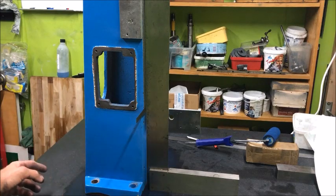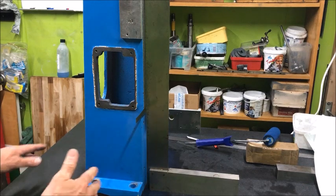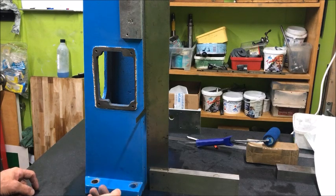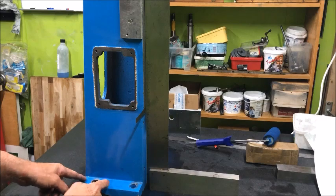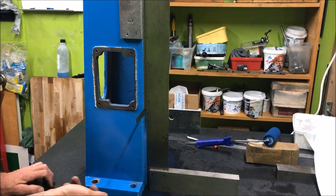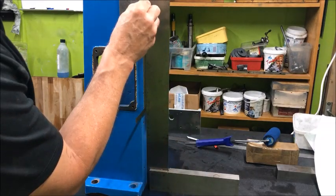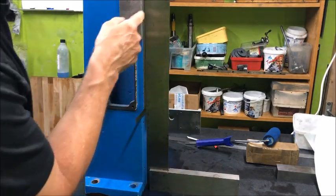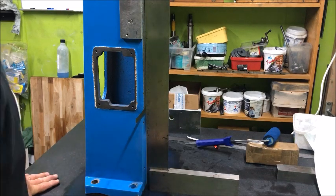Freestanding, the column is tilting backwards. I've now done quite elaborate investigations into this and found out that it is high in the middle. Measuring at the rear side, there was a gap. Four hundredths of a shim here, ten hundredths — I'm talking hundredths of millimeters. So maybe on this distance, roughly, I would say fifteen to sixteen hundredths of a millimeter.